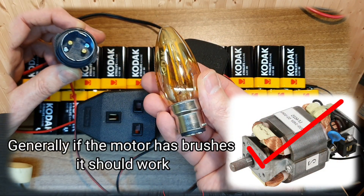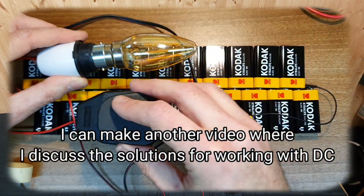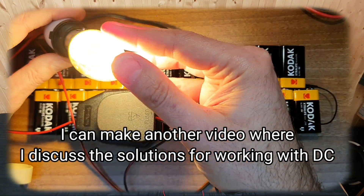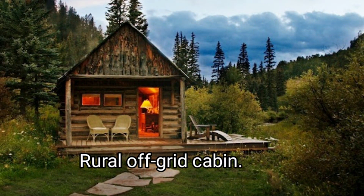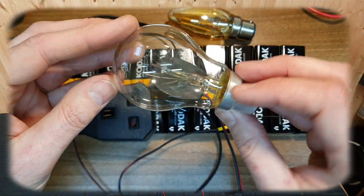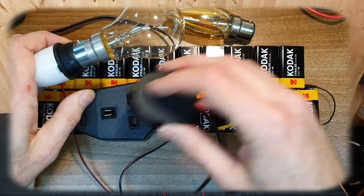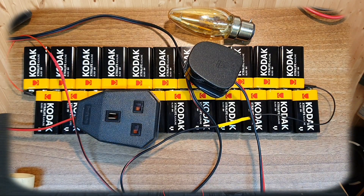There are some issues with DC as well, like switching it on and off. Some switches aren't rated for DC, so you'd have to modify a few things. But in theory, you don't need an inverter — you can do a rudimentary off-grid house with all DC lighting. The appliances can run directly off of DC, and I think that's pretty incredible. It should be more reliable as well, because the inverter is another point of failure and another point of inefficiency. You lose some of your energy just converting it into AC, so why not run everything directly off of DC if you can?